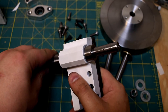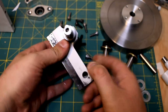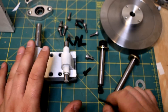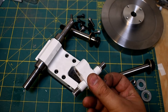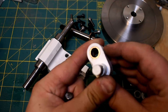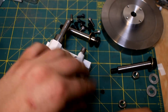This is the moving jaw assembly — it's permanently put together, otherwise I'd take it apart. You can see it's eccentric by about half a millimeter. If this rotates and is just pinned in place, it's going to want to push the moving jaw down. So we have to add a degree of freedom, which I did by putting a rocker link in the bottom — and this is not my idea, it's how a lot of jaw crushers are made. The first design goof is that the rocker link catches on the radii, which were supposed to be smaller. I had to grind away some material. This has been fixed in the drawing package I'll put up on Patreon.